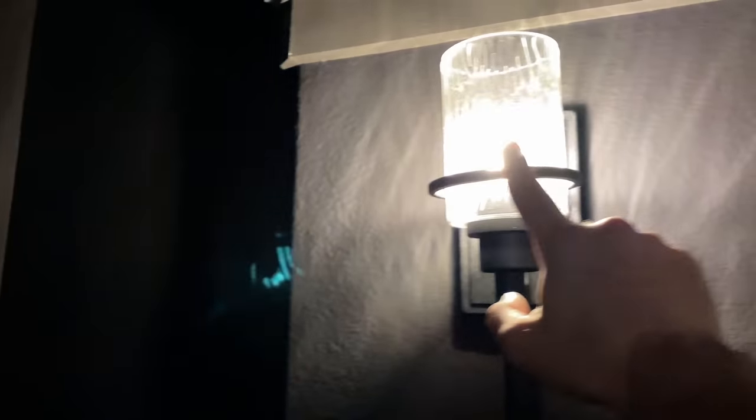Let's show you a quick up-close of the screen. You can see here — and this is an artifact — even the wife, whenever I showed her a picture of the room, she's like, why does it look like it has waves in it? The screen doesn't have waves in it; it's just the way these little sconces project light onto the screen itself. The Zero Edge Pro — the customer wanted to install their own set of LED lights behind there, so that's coming later on. I think that's going to look really cool, especially since we built out this custom box from the wall. This is an exterior wall, they had a quadruple stud — two by four stacked — so to put a speaker in there it just wouldn't work. You really couldn't cut the drywall, it'd be cocked to the side, and it wouldn't give you a realistic experience. So that's the reason we went the extra mile and built out the box itself.